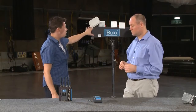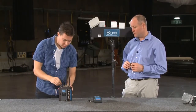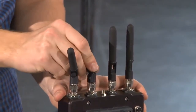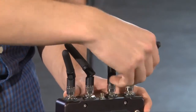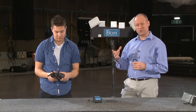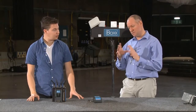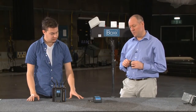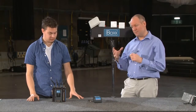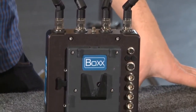Similarly to the receiver, we're trying to get the best spread of signal for the studio, so we want to do the same thing on the transmitter. These antennas have got little knuckle joints, so we'll point them to the four corners of the unit. This is a particular trait of MIMO — unlike a traditional COFDM system, we're using four antennas in the same spectrum to send the signal. It's very important to create differentials between those antennas with different polarizations, allowing the receiver to pick up different parts of the signal and combine them to get a very robust signal.